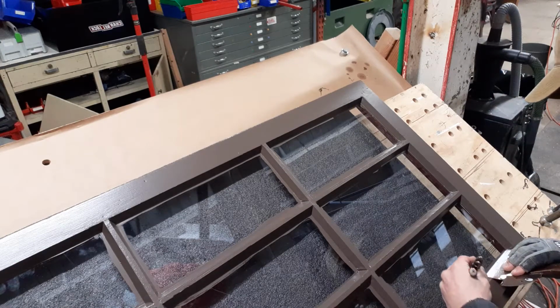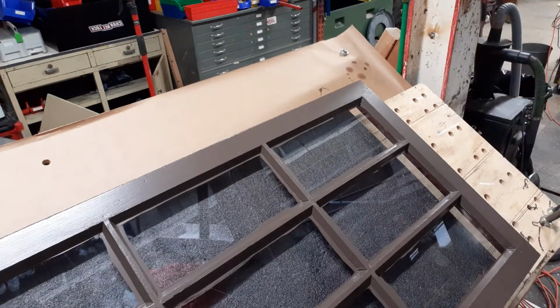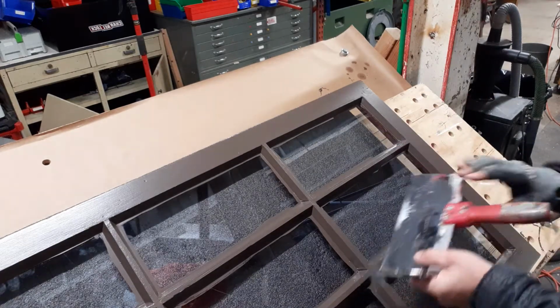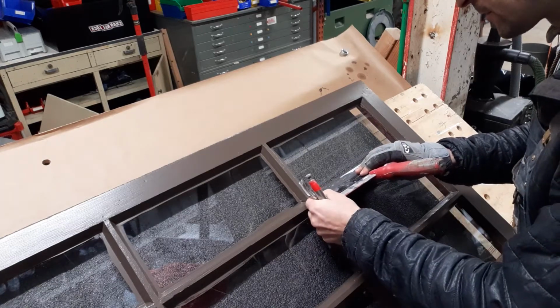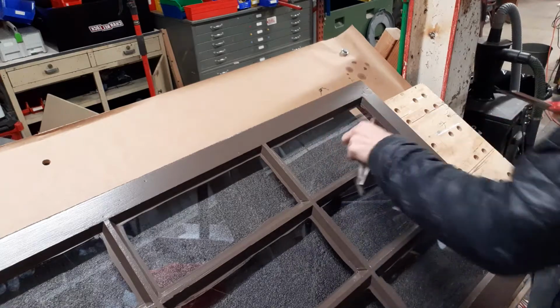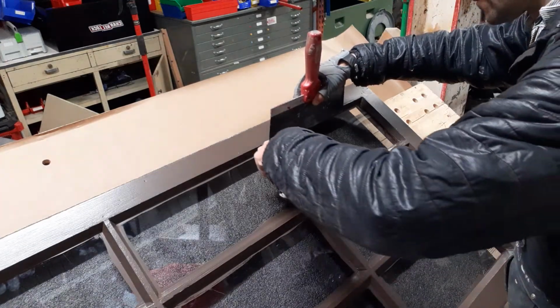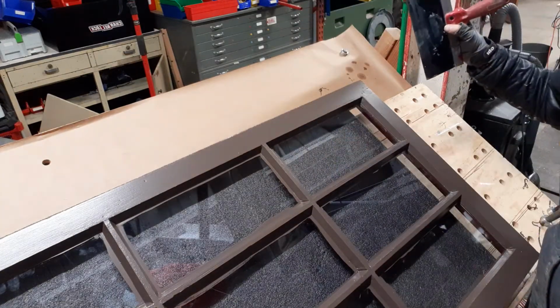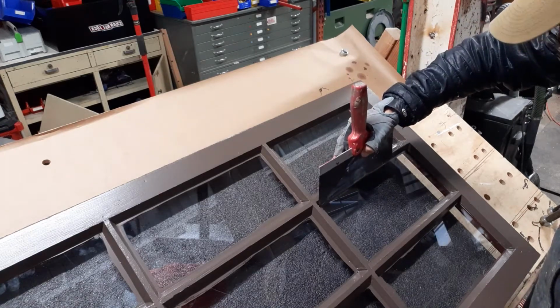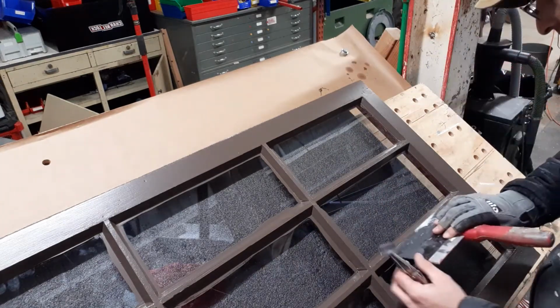And because your glass isn't covered in dried oil or pumice, it's so much easier to clean this stuff off. Let me see if I can get you a close-up here momentarily. So I'm going to take my slightly longer taping knife and get it in its corner. If you've had too much coffee and it's the afternoon, you want to use 2 hands, set it in its place right there. Always take off your little ribbon. I just drop it on the ground because this latex paint, for some reason, is always kind of sticky, and if you leave it on the glass, it'll re-stick to the glass. Oil-based paint doesn't do that. It kind of breaks up and turns into powder. Keep your work clean as you go along.